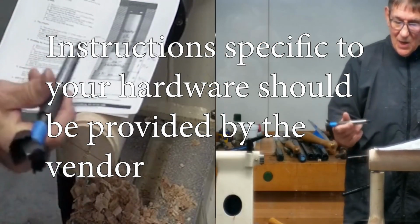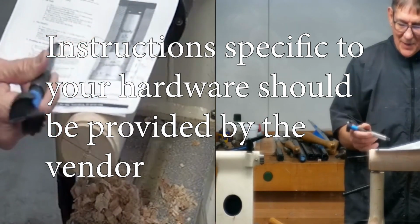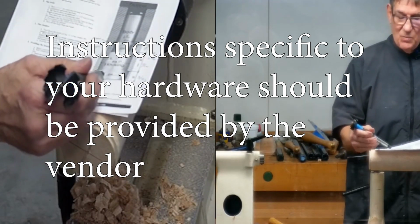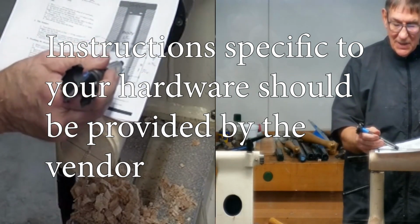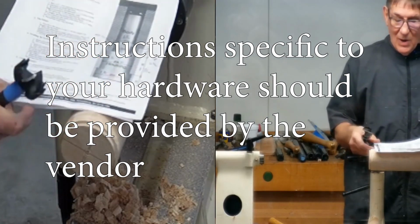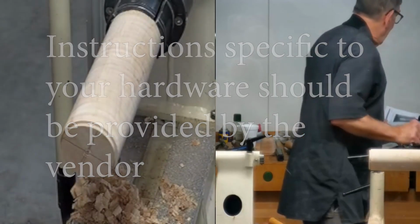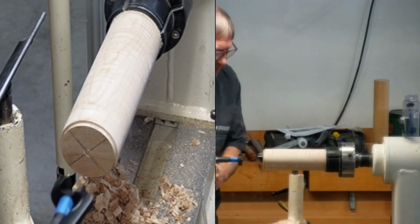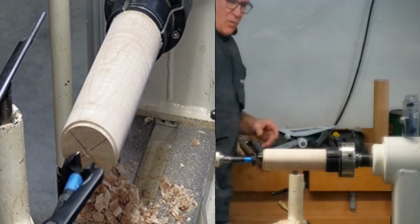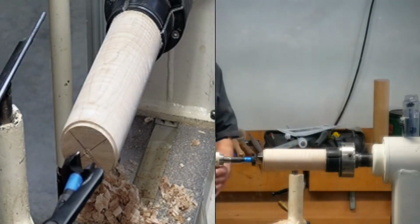We're going to go 3/4 of an inch deep, then 1 7/16 deep. This is a 1 3/4 drill. They say 44 millimeters, which goes into 1 3/4. The housing, they say 38 millimeters, which is 1 1/2. And we're going to go 1 7/16 deep on that. So we're starting out with the 1 3/4. We're going to go 3/4 of an inch in. I have a piece of tape for that.